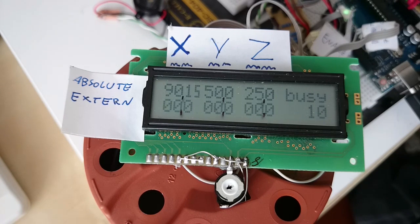The LCD allows you to define 8 characters pixel by pixel. I used this function to design 7 two-digit numbers from 10 to 16 as only a single character, so that the number before the comma always fits into 2 digits. I have also created a narrow version of the number 5 that I can put at the end of the number so that it is clear to which number the digit belongs.